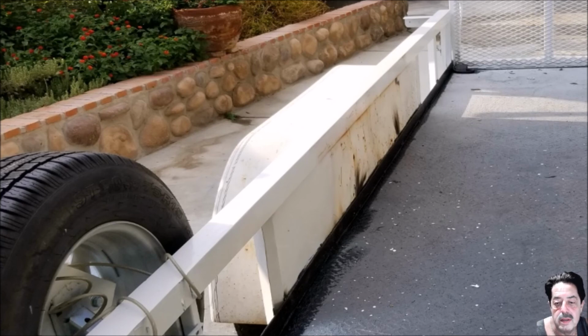So what I did is I went along all this sheet metal, both the fender on the outside and the inside, and I used my 4.5-inch angle grinder, and I touched up all the welds that I had to. Then I got my random orbital sander. I'm still using that 80 grit disc on the 4.5-inch angle grinder, and I'm using 80 and 120, just depending on what I had laying around and how bad the surface was. I got all that surface rust off of here using my random orbital. It didn't take me that long.